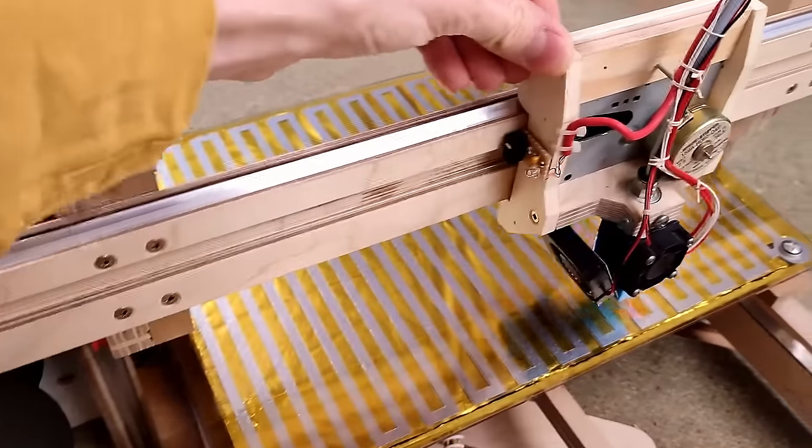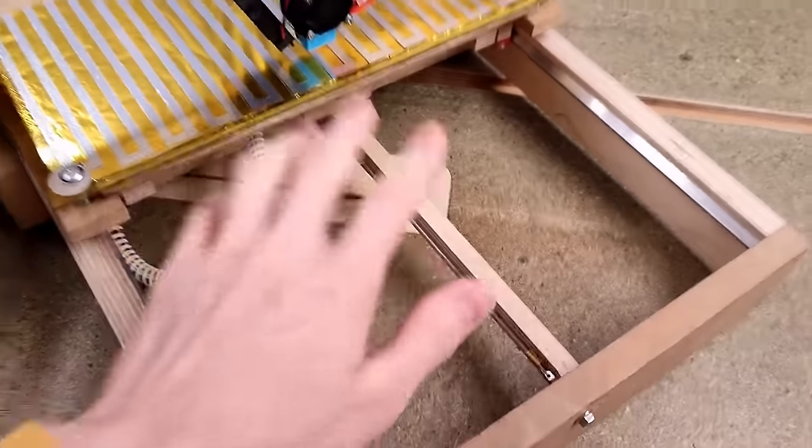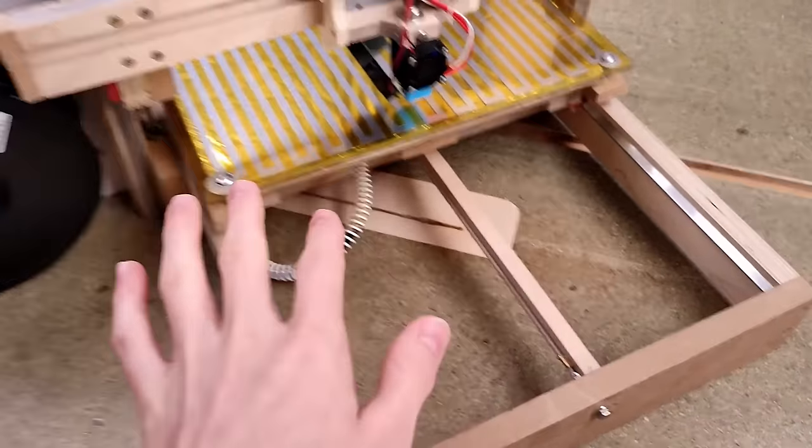Regarding my cable drive system on the X and Y axes, there's a few interesting things to mention as well. First and foremost, it's not reliable, and that's entirely my fault. When I discovered the cable drive in that typewriter, it served as my inspiration, and I really wondered, why isn't this amazing technique used anymore these days? It's so incredibly simple! Just use steel fishing line, wrap it around a driven cylinder, and bam! You got a linear drive system without complicated parts like timing belts, pulleys, or idlers.